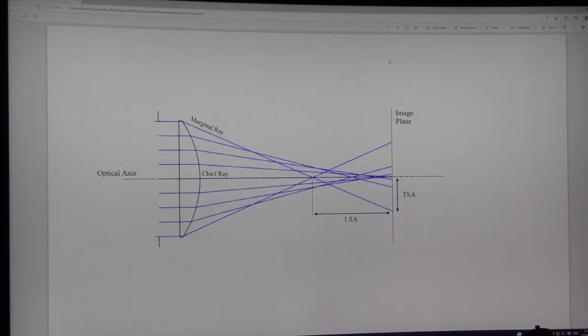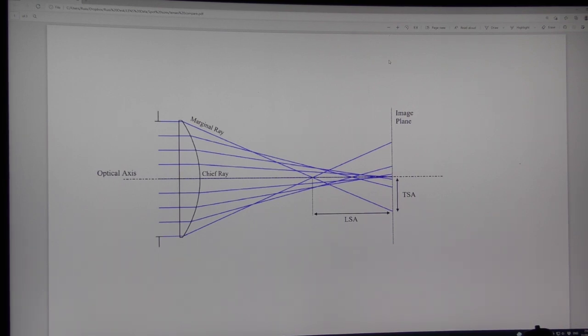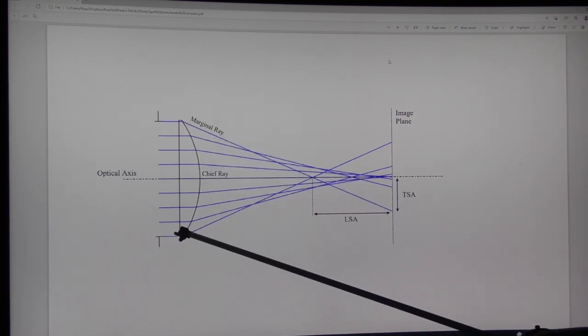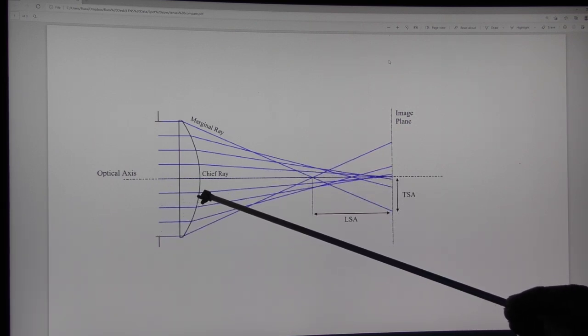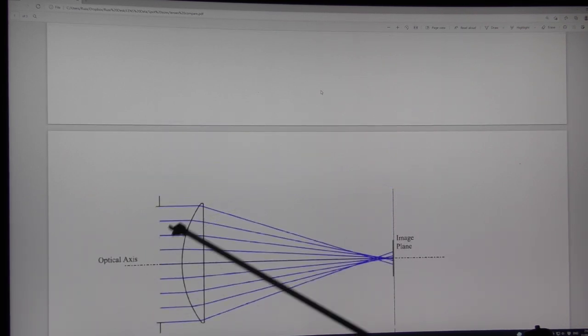Okay, let's look at one of the sort of lenses that we might use in our machine. This is being one of the common ones, something called a plano-convex lens. Now, the problem with this lens is the spherical surface causes all sorts of strange refractions as the light rays pass through the lens, because this is not the way that a lens is designed. Look at the focal point here. It's a disaster. There is no focal point. This is the way that the lens has been designed.